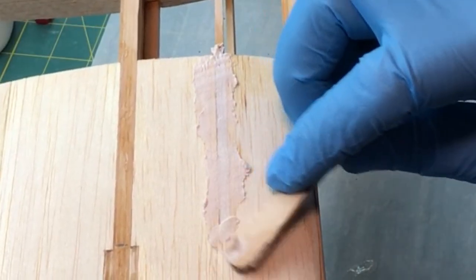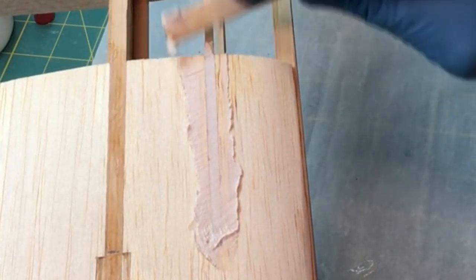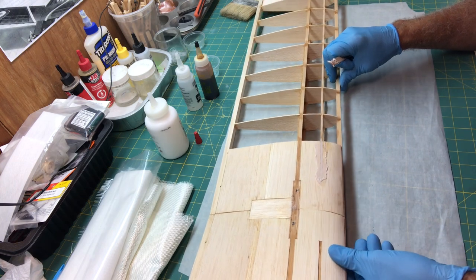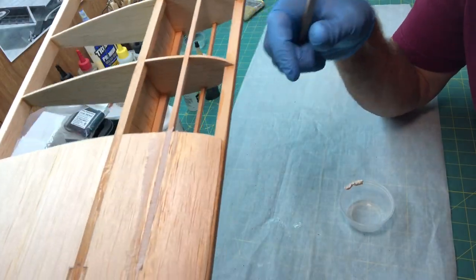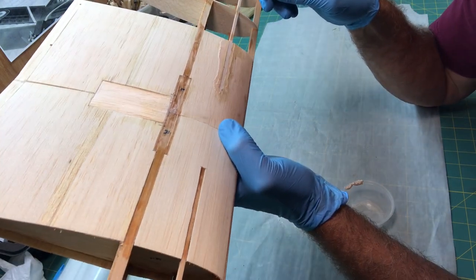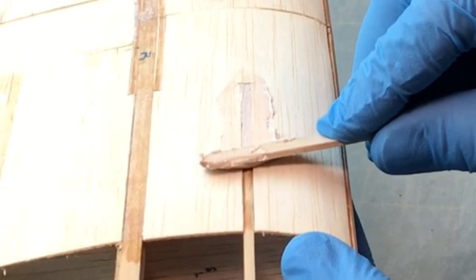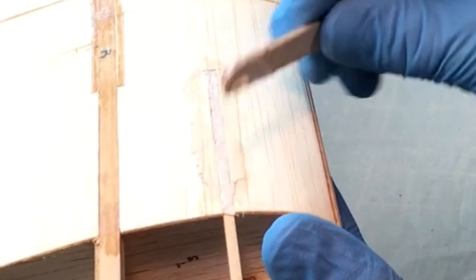As I mentioned, it's not like your typical epoxy. If you were doing this with typical epoxy, it would be very difficult to sand off when it cured up. In this case, it's going to be very easy. We don't have to worry about putting too much on other than giving yourself a little more work. You can kind of see that one right there — it just fills in nicely. It's really fun stuff to use — it doesn't shrink.